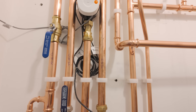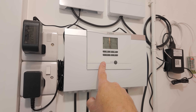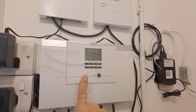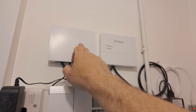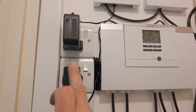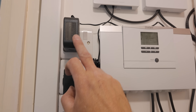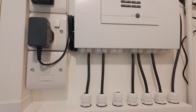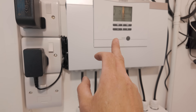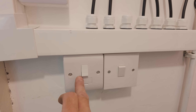On the control side: the heat pump interface unit — this is really not for the end user — a receiver for the controls, an internet gateway, power supply for the internet gateway, and power supply for the monitoring. If you install monitoring or an internet gateway you need two additional sockets, a spare switch here for the controls, and a backup immersion heater right here.